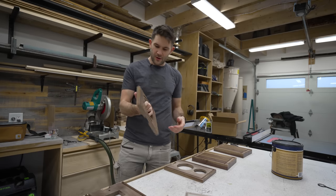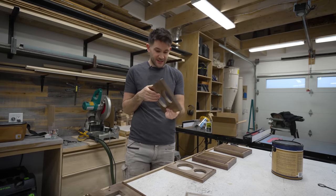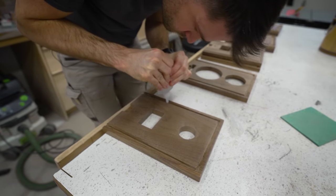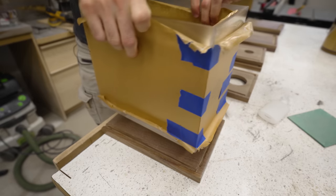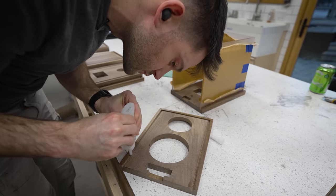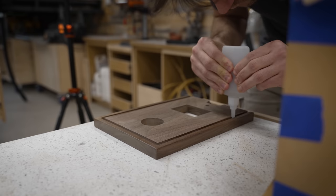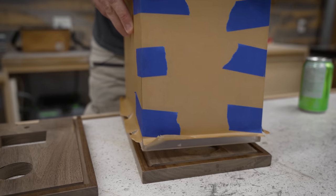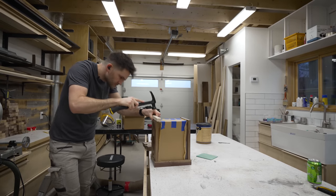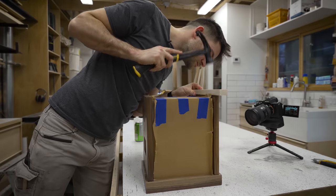All six of our wood pieces are now sanded, finished, and looking pretty nice. Now we are ready to do some assembly. Neither wood glue nor acrylic glue really works that well to bond the two together, but what I have found that works well is CA glue. I squeezed out a thin bead into the CNC-cut channels and then slowly lowered the acrylic into position. These channels are so tight I'm not sure I even needed to use glue, but better safe than sorry. Slotting the tops onto the bottoms required a bit of percussive force — you want these joints to be as tight as possible so that the speaker panels don't rattle around when you're actually using the speakers.